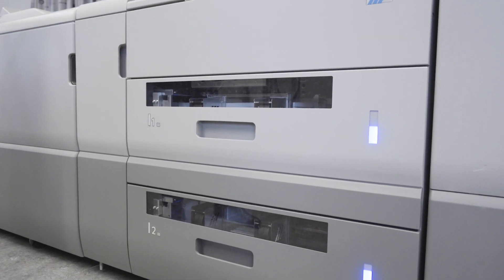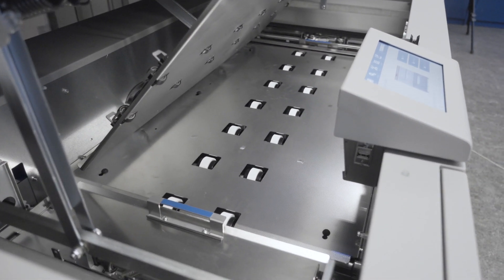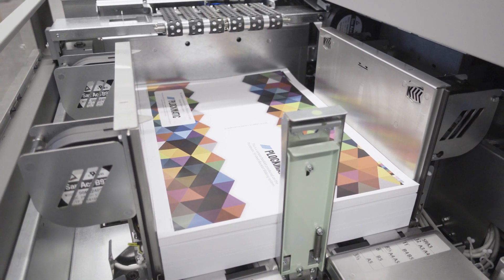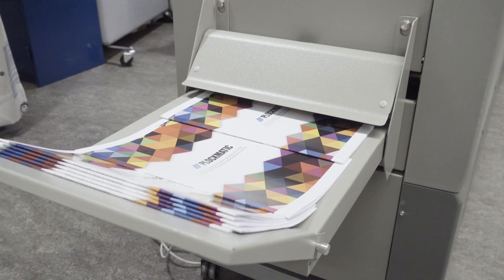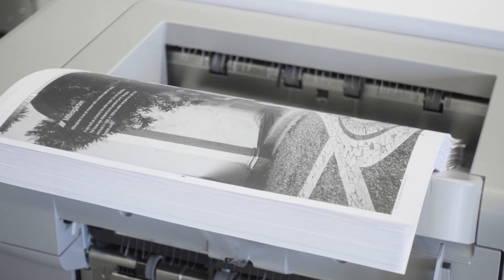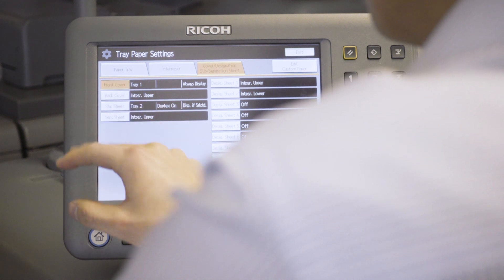The HCI contains two oversized high-capacity paper trays and a bypass paper path, which allows for custom sequencing of sheets from three different sources: the two trays and the printer's output. This means that offline pre-printed media of different types and formats can be integrated into the finishing workflow downstream from the print engine, opening the door to applications including inserting perforated sheets, laminated covers, or material printed offline from an offset printing press. These materials can be preloaded and sequenced into the print process.